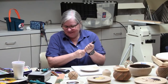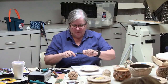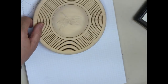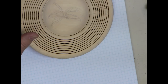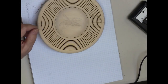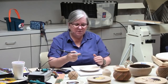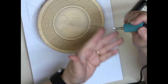I'm going to switch tips here. This is what I like to use for a shading tip or for outlining. I turn it down — it's probably at between a one and a two, fairly low. The Optima tips are pretty thin metal and heat up very quickly. When you're going to do shading, you really want to test it. It's a shading tip that appears to be perfectly flat on the bottom, but it's not — it's slightly curved.